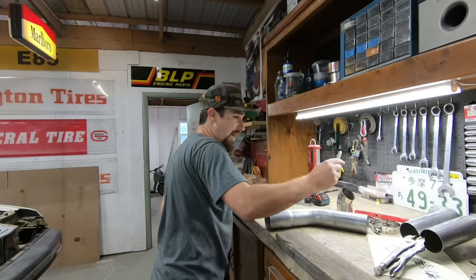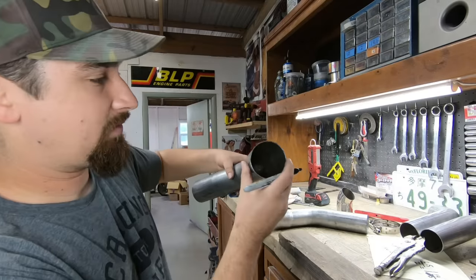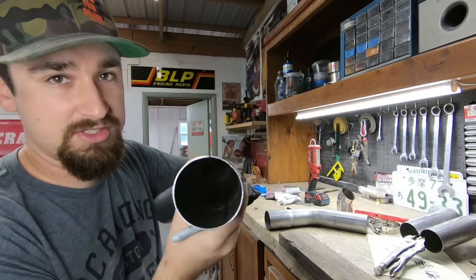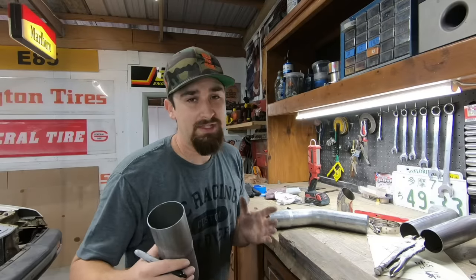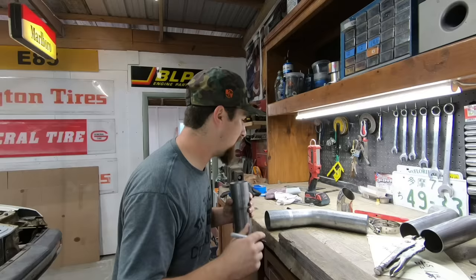So I just go ahead and find my 12 o'clock position. After I figure out what that is — let's just do this as an example — let's say I wanted to angle this much, and I figure out that I want my 12 o'clock position to be right there. Now what you've got to do for a Y-pipe is cut the Y-pipe in half so that way the two pipes can become one — that Y shape. So we've got one mark; now how do we find our other mark?